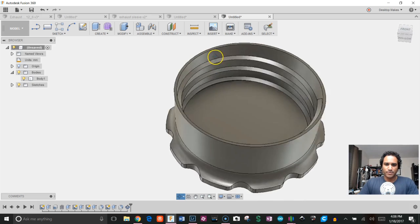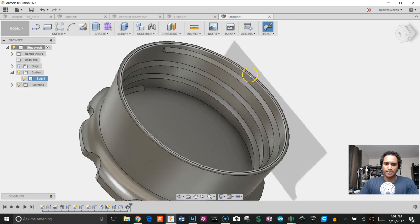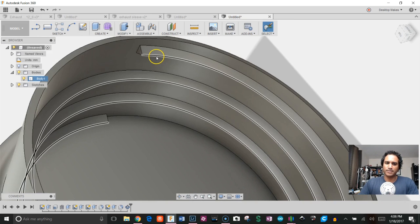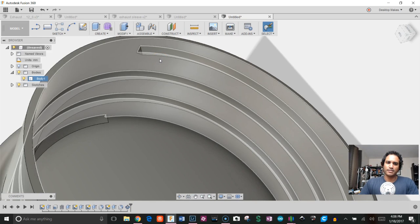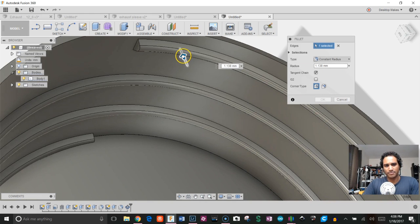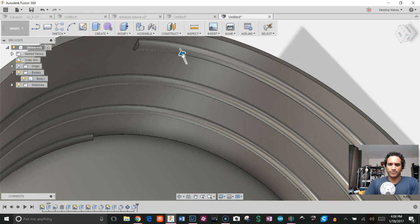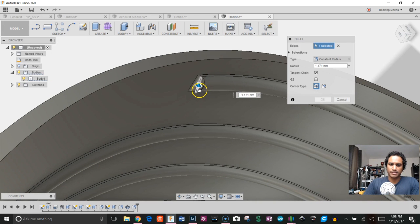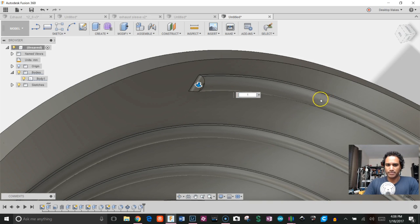Last thing: because of the nature of the fitting, the threads are more rounded than a sharp triangle. I'll apply a 2-millimeter fillet to the thread triangles to better match the fitting, and one final 1-millimeter fillet to smooth out the transition at the base. That's it — there's our threaded cap.